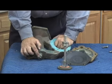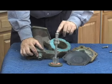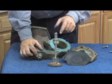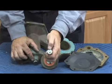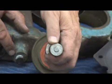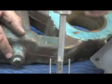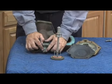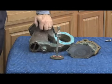There's a plug underneath which doesn't have to be replaced or removed for the average repair unless this spring assembly here came apart. Sometimes, unfortunately, when you pull this relief valve stem out, the spring is gone or the clip on the end here, because they use a very small E-clip, as you can see right there, that holds that relief valve stem together. And we've already talked about the concerns for an E-clip, and if the E-clip's put on incorrectly, that spring will come apart. So hopefully the stem will be just like this with the spring attached, but if you take it out and the spring's not, you're going to have to turn this plug to get the pieces out of the body. Disassemble of the relief valve stem.